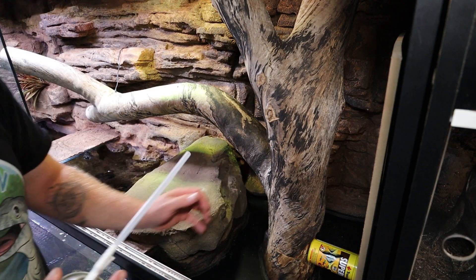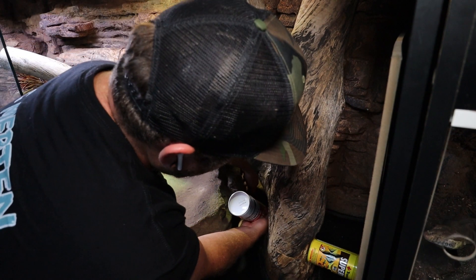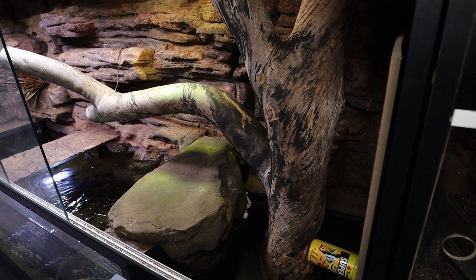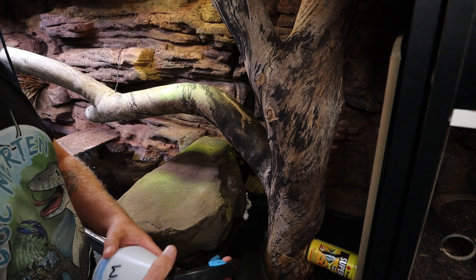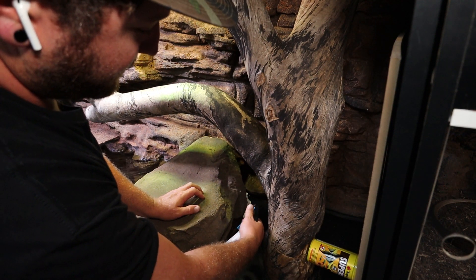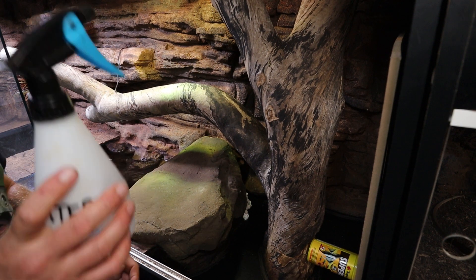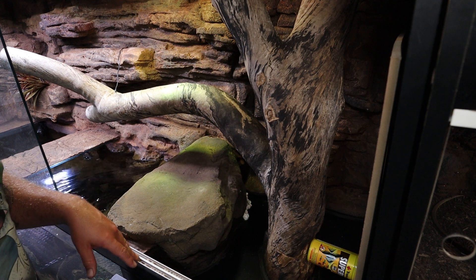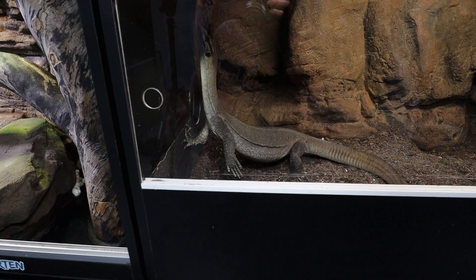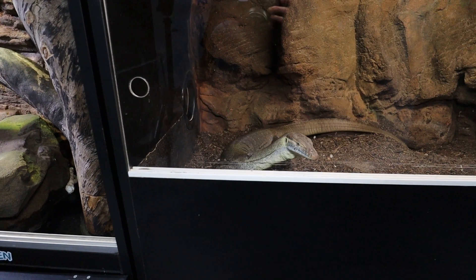This is a bit of an old can — hopefully it's still got some foam in it. Yes, lucky! Just in under here — nice. Now that foam is going to expand to three times the size. Spray foam is actually moisture-activated, so if you want to give it a little hand I always just have a little water bottle and give the surrounding area a bit of a mist — that puts moisture in the air and helps the spray foam to do its job. Now we just need to wait a little bit for that to dry, then we'll carve it off and silicone it up. Easy job! Poor Doc's wondering what's going on — she sleeps a lot in here anyway buried down, she's probably just not too happy about not having the choice tonight, but it's only for the one night and she'll be okay.